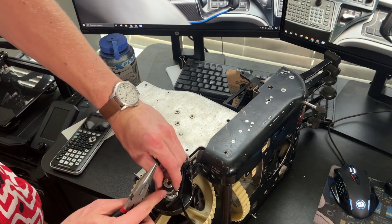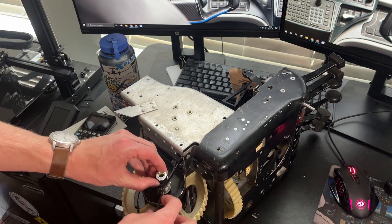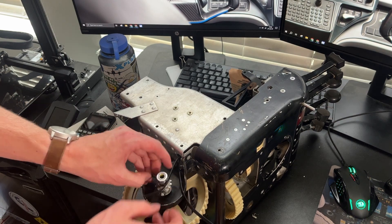One idea I had was to take a bit of rubber, adhesive it onto this sprocket right here, and then it would catch on the teeth of the rubber. This is what I call a bad idea — one that doesn't work. I feel like it's really important to share my bad ideas as well as my good ones, to show why they didn't work, because a lot of learning comes from these bad ideas. I did some preliminary tests and scrapped it. The main reason is: if you imagine bending a pool noodle, the bottom compresses and the top stretches — the top stretching of the timing belt makes the teeth spread out more than they should be.